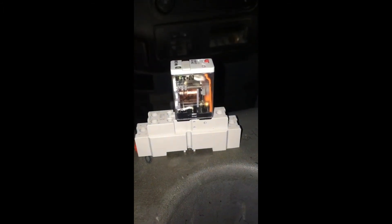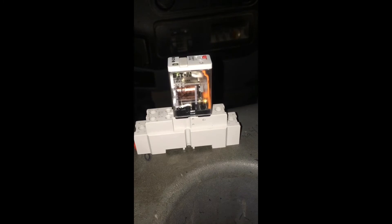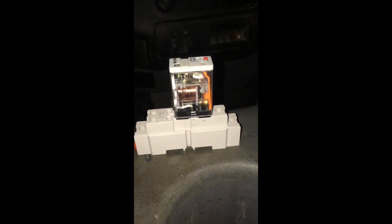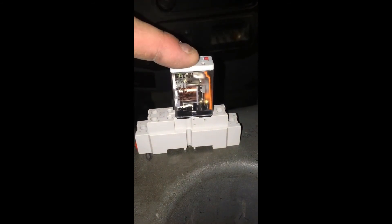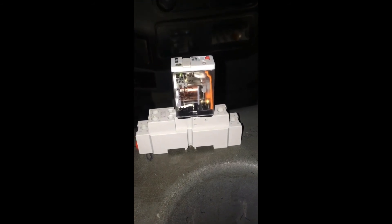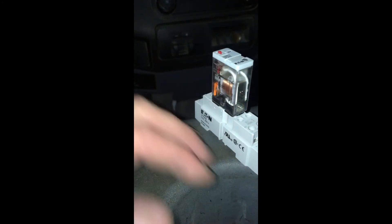The reason this is great: if you went directly to the motor starter or contactor and there was a power surge or something failed, you would destroy that contactor — which can cost anywhere from $50 up to $500. This little ice cube relay is about $8, so it's a nice protective measure.